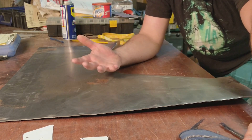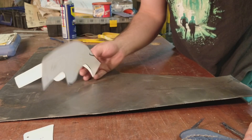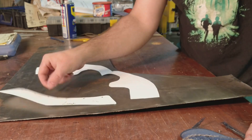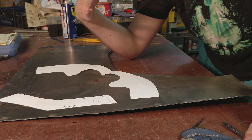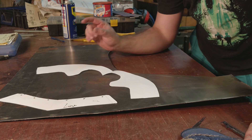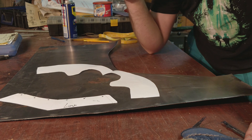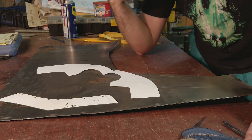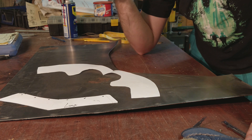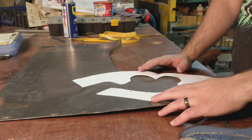Now that we've got our helmet dome ready, we're going to get our other portions of the helmet cut out. These are our monkey cheeks — our cheek plates — and this is our brow plate that will hang over the brim. We also have a neck plate, but we're going to put that in 16 gauge, a little bit thinner, because it's not going to be taking any direct hits — the Shikoro is going to be covering it. It's really just a backup plan, and we want to cut down on weight. So we're going to get these lined up, traced out, and cut out.